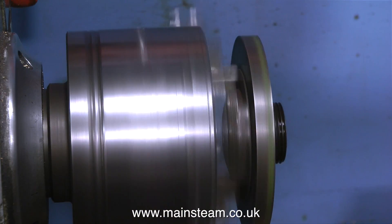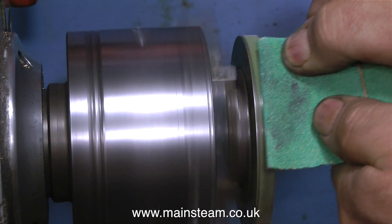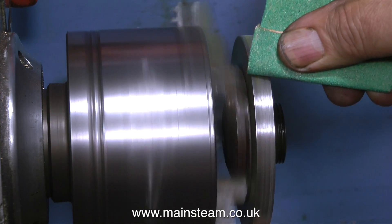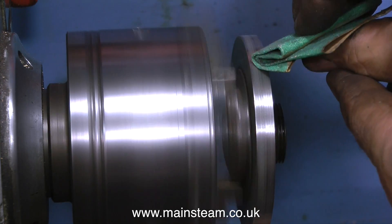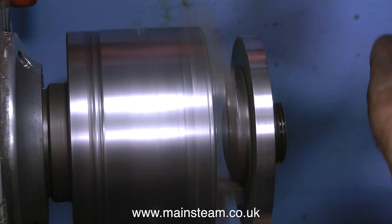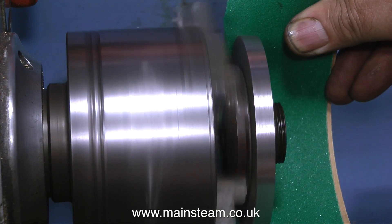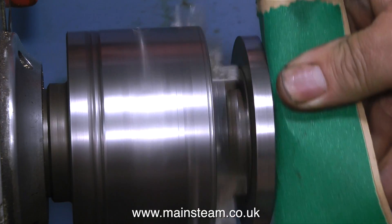It's time now to put the lower cylinder cover into the lathe and use some sandpaper to clean it up. Here's another example of why I use cheap sandpaper for this sort of job — it's made out of a stiff paper, and the more you fold it the harder it gets, almost like a multi-toothed lathe tool. By doing it this way I can keep my fingers clear of the rotating piece of work, plus the chuck jaws. I could of course skim it with a lathe tool, but then the part would get much smaller because it's not bound to be 100% concentric. I'm using 80 grit sandpaper and then changing to 120 grit to get a finer finish, and this clip also shows me cleaning the underside of the lower cylinder cover with 120 grit sandpaper.